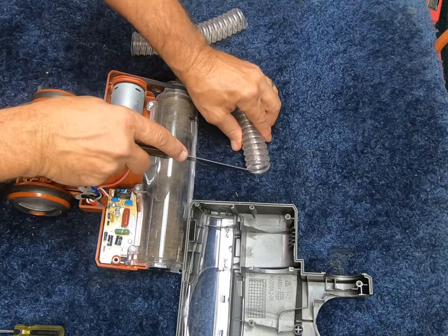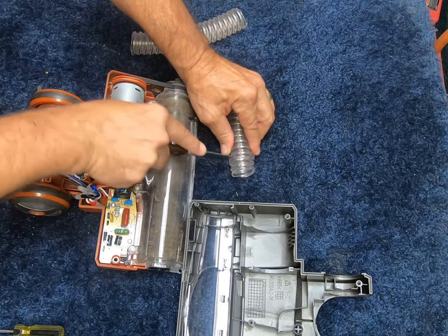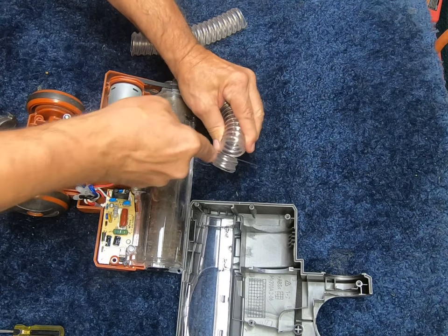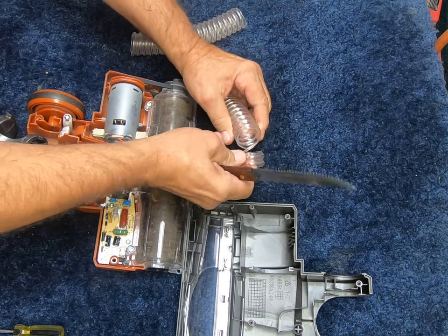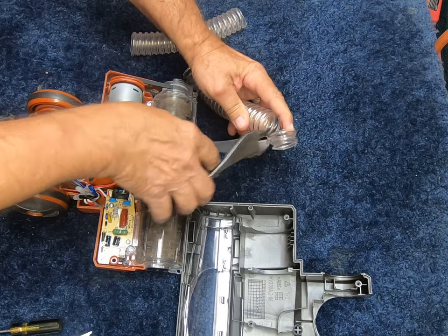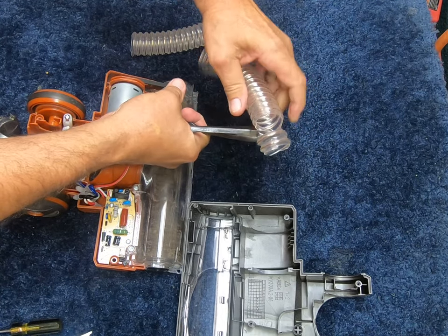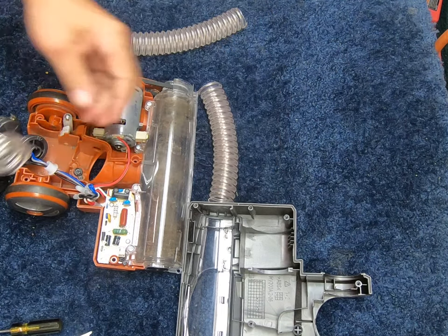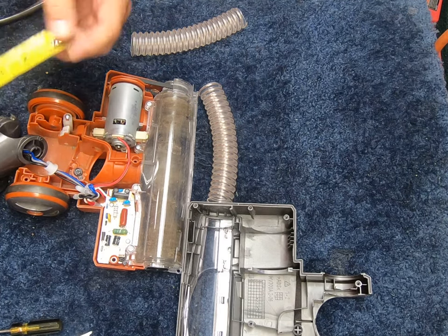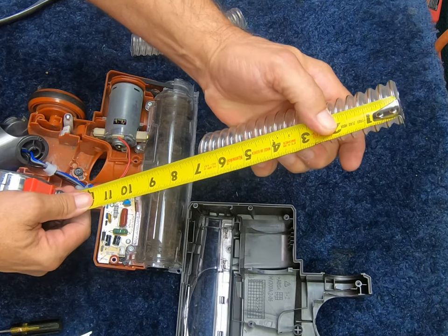Let me try and get a better view here. Just went like this — it won't go through the metal with the steak knife, but you just get it all the way around. Once you get it all the way around so it kind of looks like that, go ahead and get some side cutters — they're a thicker type wire cutter — and just snap the metal wire and it's at the correct length. The correct length that I'm putting in here is about six and three quarter inches. So that's ready to be installed.